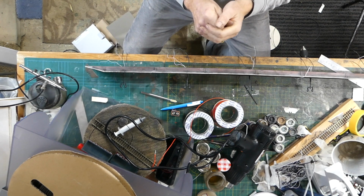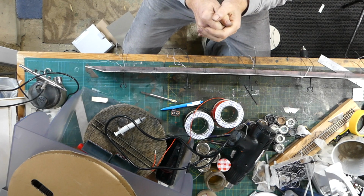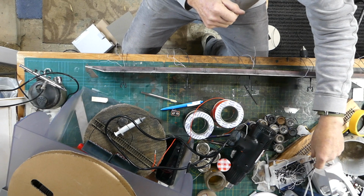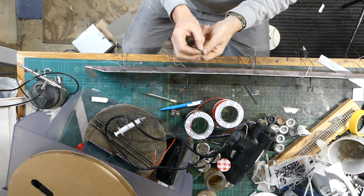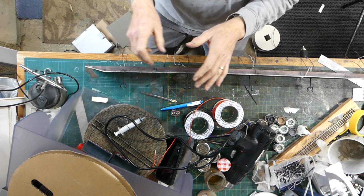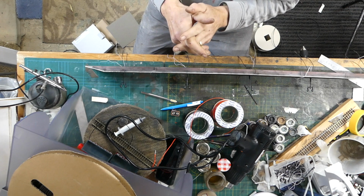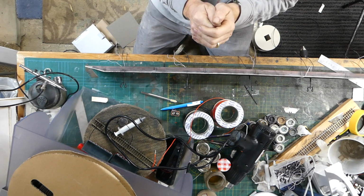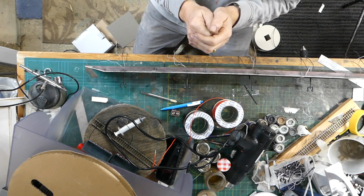As I said, I was doing some street lights with some of this stuff a couple of weeks ago, and the first ones I put up I actually melted. There was not much left of them. They weren't usable. I chucked them away. But I did melt them because I put them up to a Hornby controller. They were very bright, so I turned them down with the slidey part of the controller, and they kept going off. So I wired them directly to the terminals at the front, and realised once the smell came that I'd melted them because I put 16 volts through a 12-volt bulb.